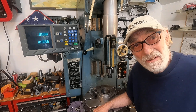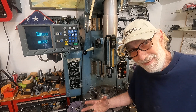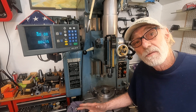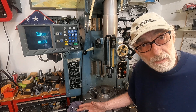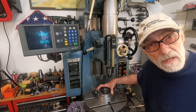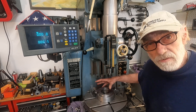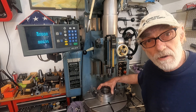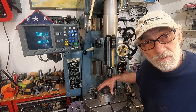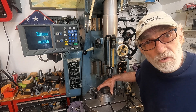Hi. It's going to rain until the middle of the week outside, though the sun's trying to peak out right now, but I don't dare pull the tarps off those machines. So I'm stuck inside doing things. What I have here is that back plate that I'm going to mount the 8-inch 4-jaw chuck to. This is the back plate that came with that Bostar thing, and I'm going to mount that Bostar chuck to my dividing head back plate, so I think that'll be more useful.